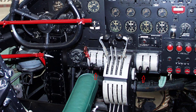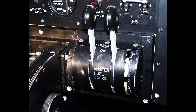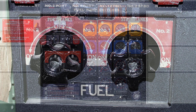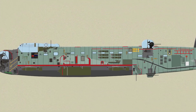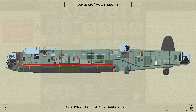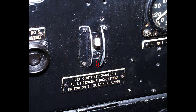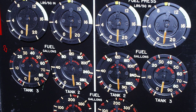The pilot controls four master engine cocks. On Lancaster 1 aircraft the master engine cocks also control the slow running cutouts. The flight engineer controls two tank selector cocks which select number 1 or number 2 tank on each side. A cross-feed cock, marked balanced cock, connects the port and starboard supply systems and is on the floor just forward of the front spar, with the handle visible through a hole in the spar cover. On Lancaster 1 and 3 the fuel contents gauge switch located on the flight engineer's panel must be set on before the fuel contents gauges will give an indication.